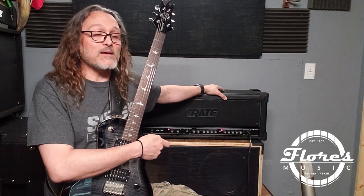This amp is an absolute crusher, but if you know anything about this amp, it has a heating issue. Some of the parts get overheated and start affecting other parts, and next thing you know you have the channel switching just randomly going on and off. The reverb will kick on and off, the chorusing will kick on and off — makes it completely unplayable.